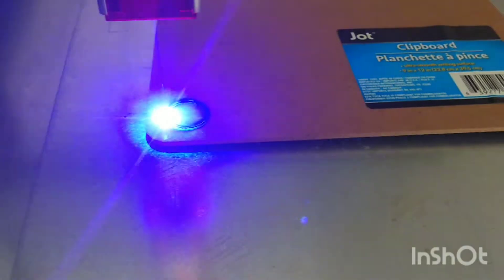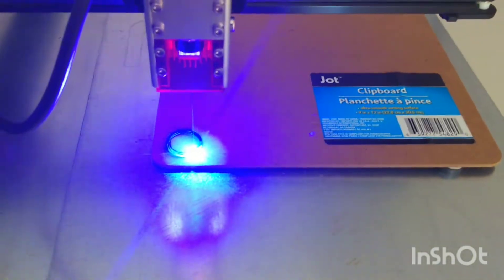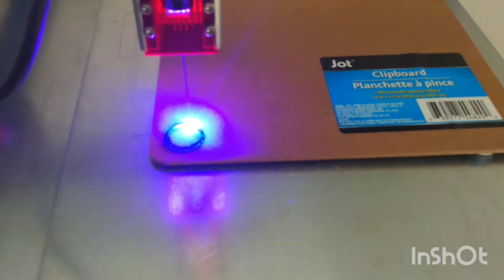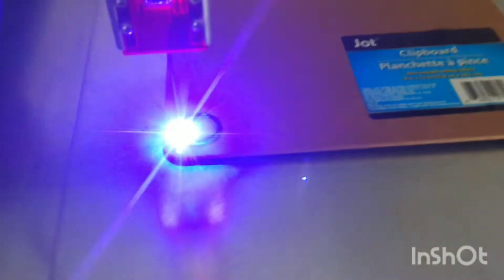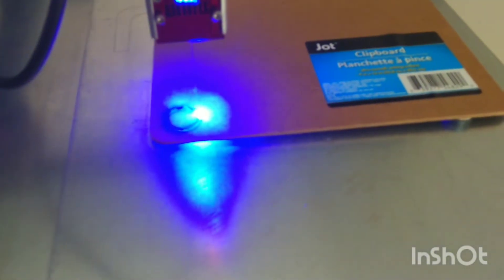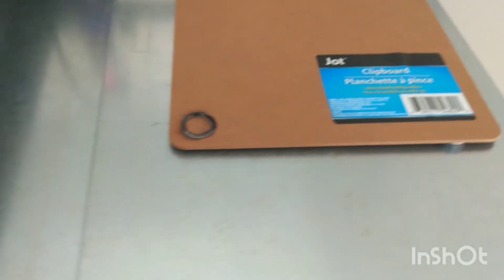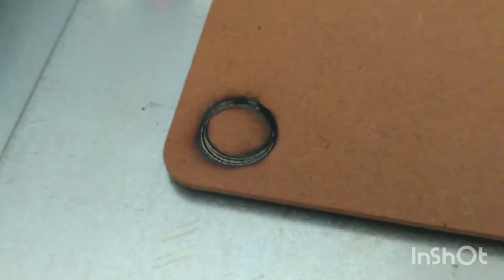This is definitely a harder material to cut — a very pressed hardwood. I'm on about pass 30, maybe 34, doing four passes at a time. I slowed it down from a faster speed. In LightBurn I'm doing 100% power and about 200 for the speed. I'm finally starting to get some light underneath the hardboard, but it's charring the circle quite a bit. It's a very hard wood to cut.